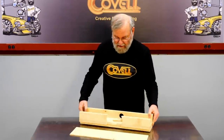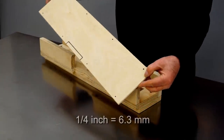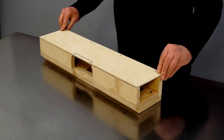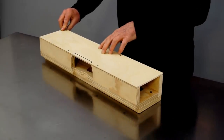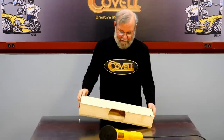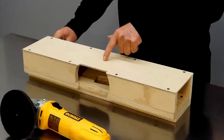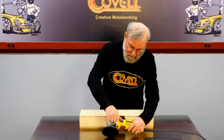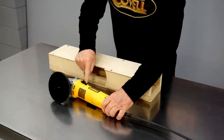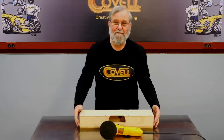The first three sides of the box are completed, and the last step will be to make the cover. I'm going to use thinner material — 1/4 inch thick plywood — which just fits into place. The next step will be to drill the pilot holes for the screws and to notch out the area for the disc. I need to put a hole for the mounting screw in the top of the box using the little transfer punch made earlier. I also need an oval hole to provide access to the switch. The last step will be to attach both hinges to the box.